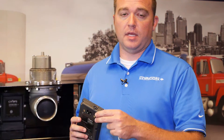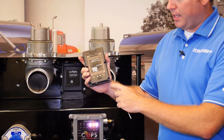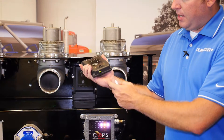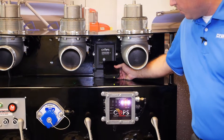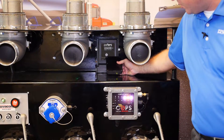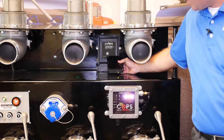Now with this elbow radio module — this is the one with the LED — most of the steps still apply as the one with the antenna. You're going to start with the LED facing the ground, place the magnet in the same corner, and you're going to see the LED start to flash. Once you put it up against the main controller, as soon as the elbow finds the main controller, the LED will go solid green.